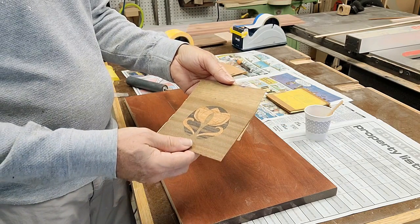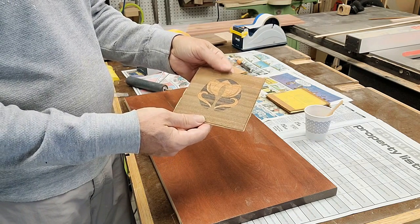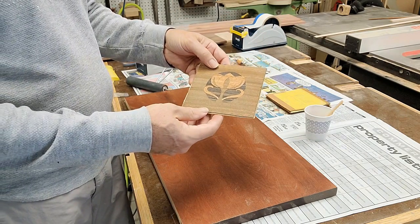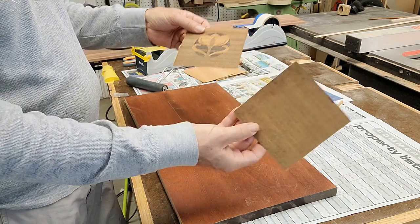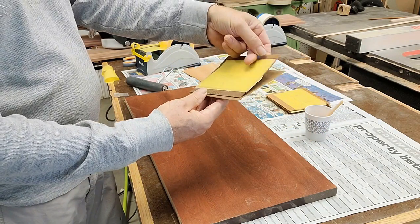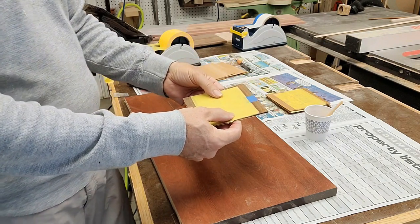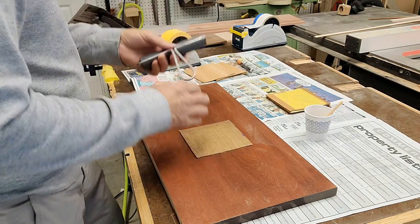And we're going to line them up with the grain in the same direction. When we're dealing with solid wood here, that's going to be the most stable way. You can do it the other way, but it potentially could run into problems down the line. So we've got the grain in this direction, the grain in this direction. We're going to put some glue on here, and then glue this, tape side up always. And we're going to glue those together. And that's about all there is to it at this step. So let's put a little glue on and go from there.